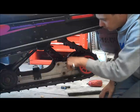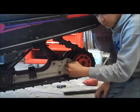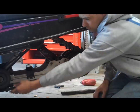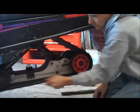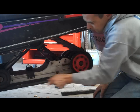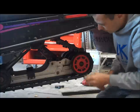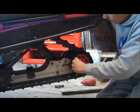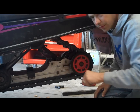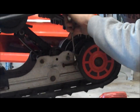You do that the same way — just tighten it up in small increments. One or two turns can make a big difference. Once you make the adjustment, run the track again to make sure it's settling in on the wheels. Run it a few times, then double check it. Once that feels good, tighten up the idler wheel on both sides, and then tighten up the jam nut against the rail — don't adjust the threaded screw anymore once it's where it needs to be.